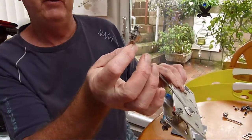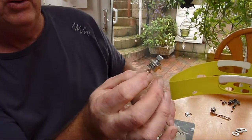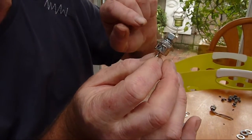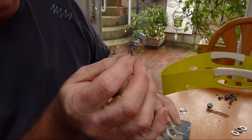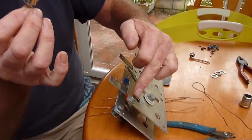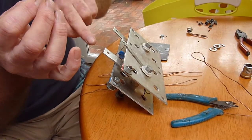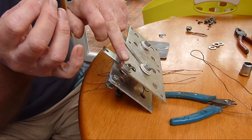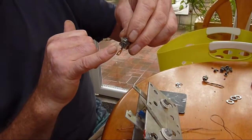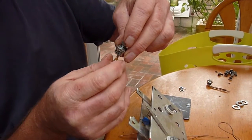The new Vishay diodes have got a little arrow, and this can be rubbed off, so be careful to make a note of which diode you've got. This indicates the direction of the flow of current. Now we know here that the torch is bolted onto this terminal, so the current flows from the centre out towards the torch terminal — so we choose the diode that is actually flowing the current back to the stud in this case.